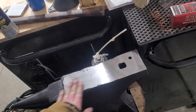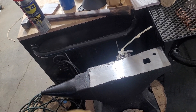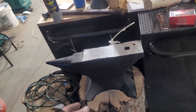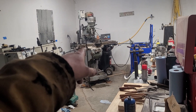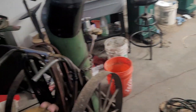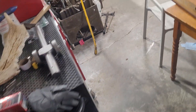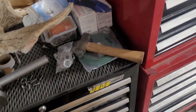I just cleaned up the top a little bit — took about 30 or 40 thousandths out to take the pits out. I got that from the same gentleman whose estate the surface grinder came out of — while he was still alive I got the anvil. Really, most of my other big machines came from the same place — same thing with the torch, the swedge block — most of the big stuff in the shop came out of his estate.